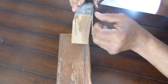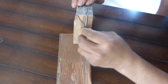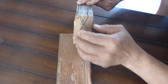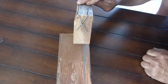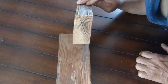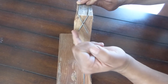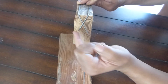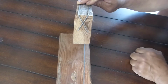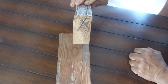Let me look in there, make sure you can see it. I just crossed the steel a little bit. I get placement of steel top and bottom. I still get 12 inches or whatever it might be. About 14 inches, 12 inches. And I get this development like that. It's still there, got plenty of cover where these tips aren't at the edge of the concrete. They get crossed, braced like that, and you get your top steel and your bottom steel.